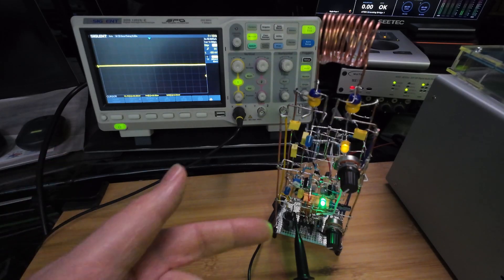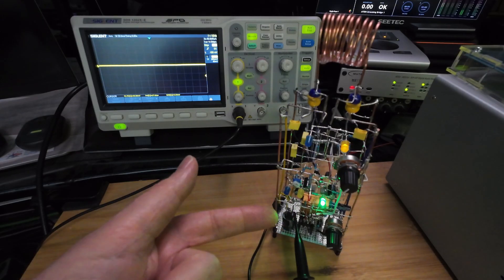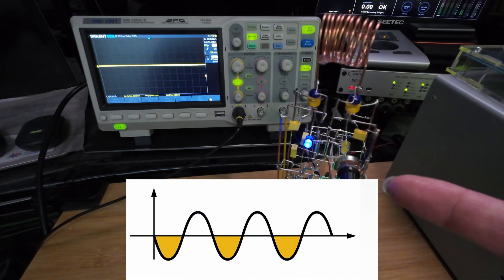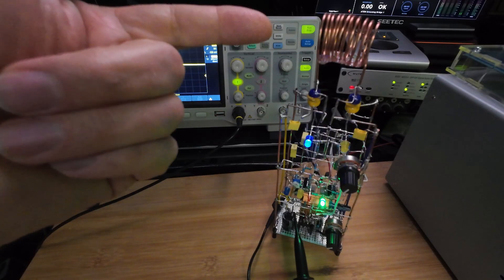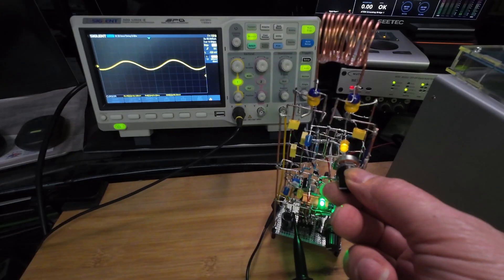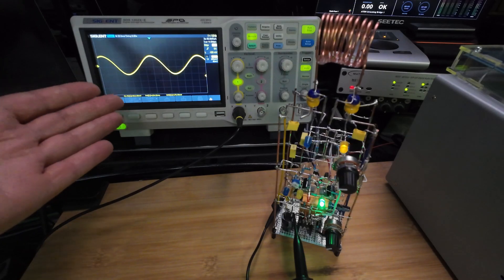I don't want you to wait too long for the final result — the proof that this, in my eyes, is not a toy but a tool. So let's switch the power on. My Schumann resonator is now online. The green LED indicates it's on, the oscillator is flashing at exactly 7.83 Hz. The blue LED shows the positive half waves, and the yellow LED shows the negative half waves. The oscillator is running perfectly. Now we give power to the main field using this trimmer. Watch the oscilloscope — this is it. We have a perfect analog sine wave, no overtones.